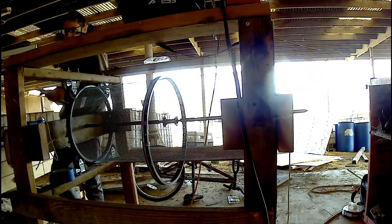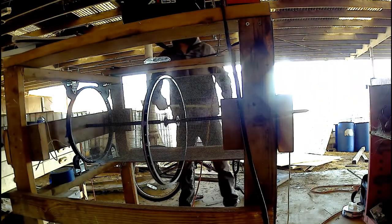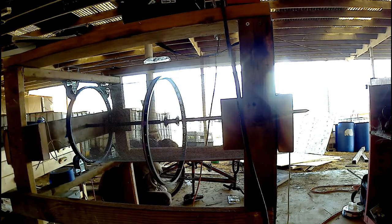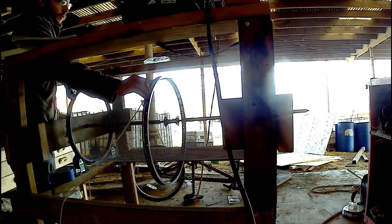I was measuring the angle to try and get it just right between those two spokes. At one point I was doing some math to calculate what part of the trommel mesh the spoke needed to pass through — taking repeated measurements, trying to get them precise enough to calculate these awkward angles and count how many squares on the wire mesh needed to be between each spoke so they would pass through in just the right positions.